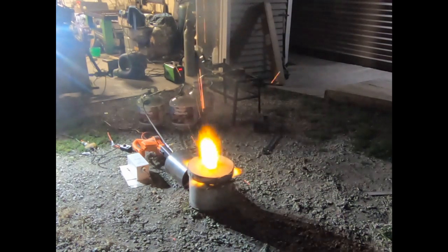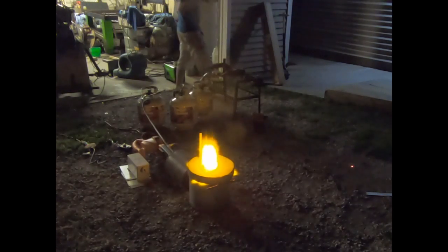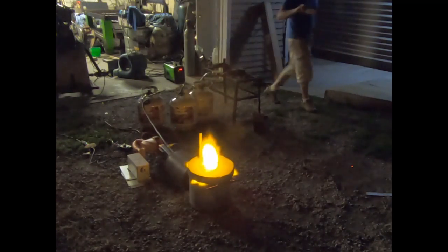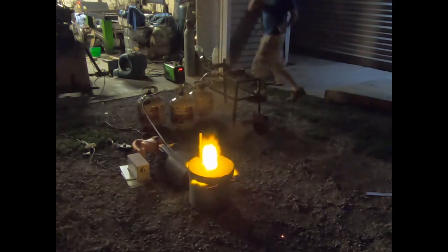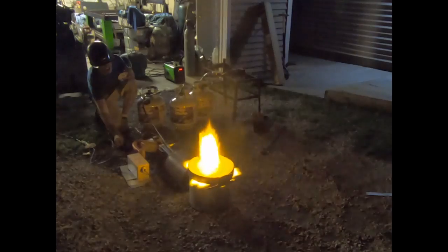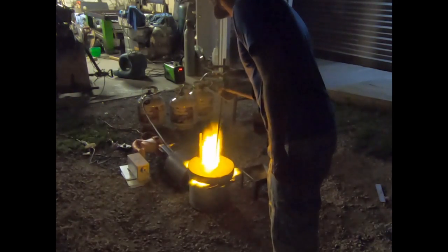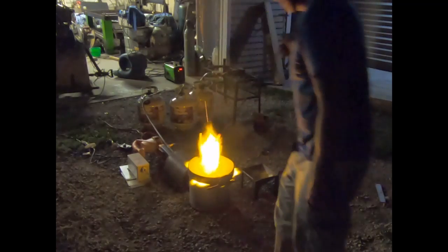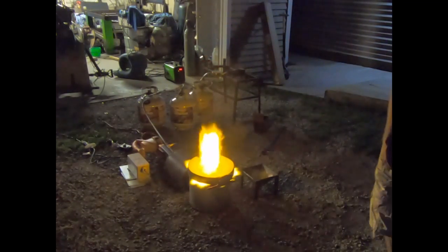You can see there it's kind of shooting out some red-hot pieces of refractory — just little bits, there's one right there. It's literally starting to vitrify some of the loose pieces of refractory and shoot them out, which means we're hitting 2,400 degrees minimum there. So I did have to turn it down because I didn't put this thing in a very good spot for this test, but we did get a little bit.